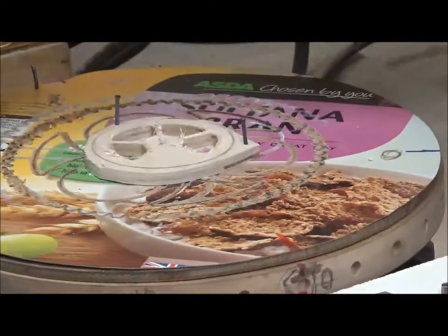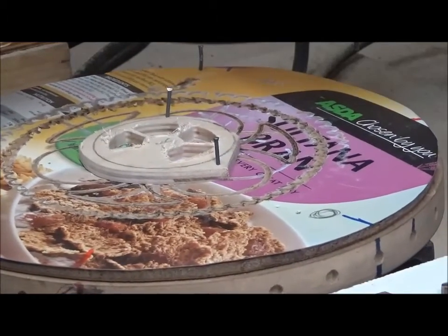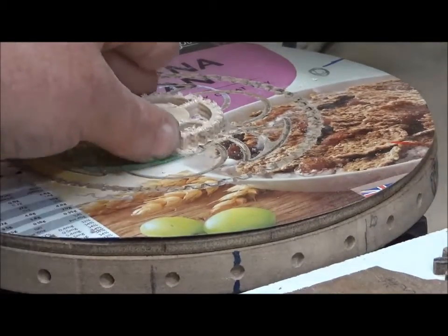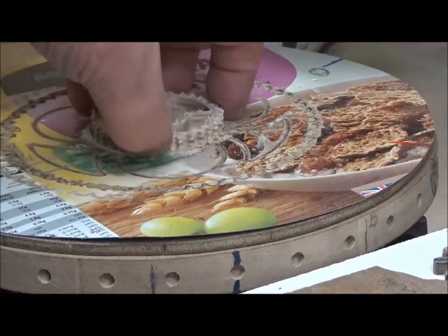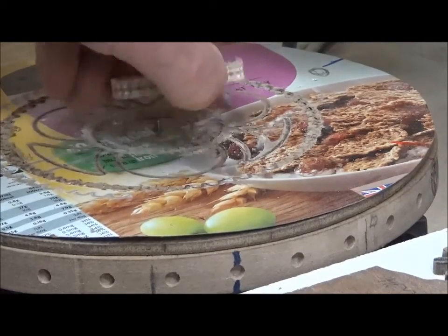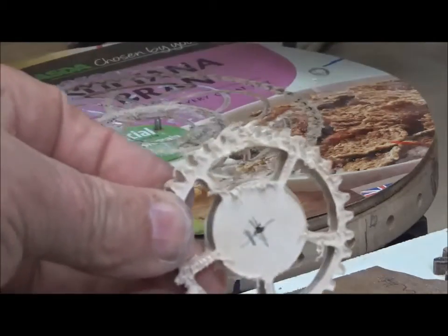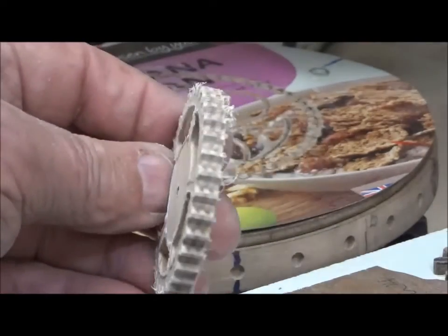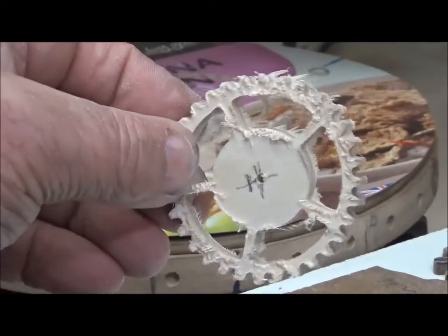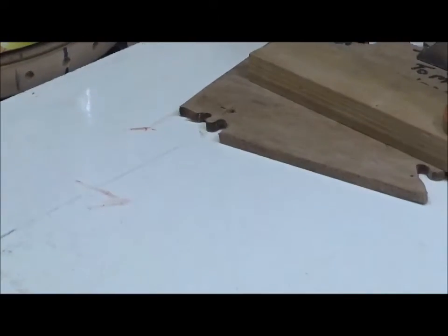Here one segment is cut out on this wheel — the table is advanced to that position, the cutout made, and then the teeth produced. This is the wheel finally finished. It gave quite a furry finish on the outside because a milling cutter was used, but once given a light rub to remove those fibres, no filing of the teeth is required and the wheel works perfectly — it's symmetrical and round.